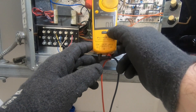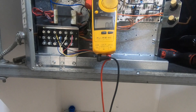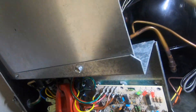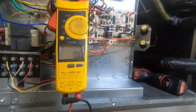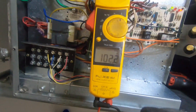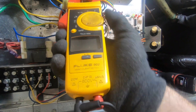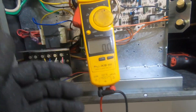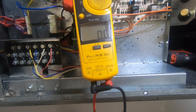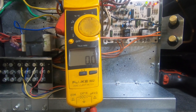Nothing yet. That was a high lock rotor. The clamps are no longer able to turn this. Zero amps. My compressor lock rotors and doesn't start. I didn't even hear a chug or anything out of the compressor — I just saw the lock rotor go up, the meter recorded it, and that was it.